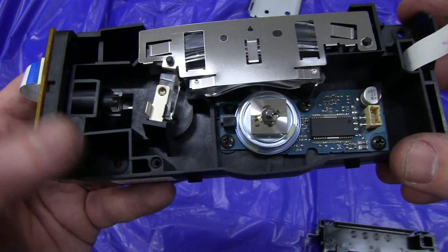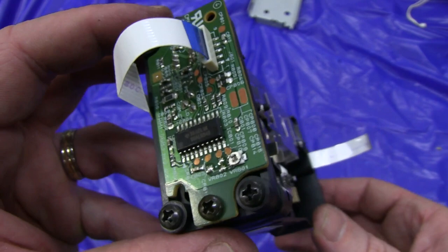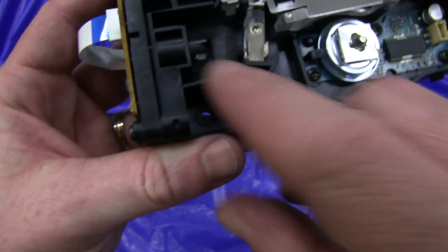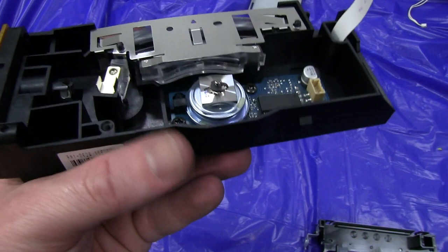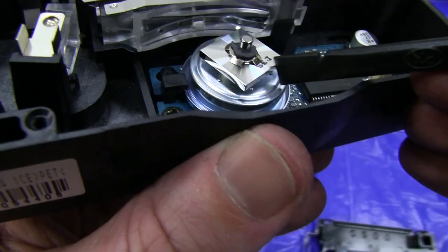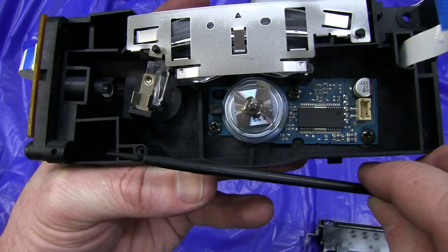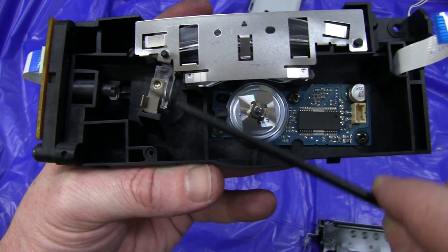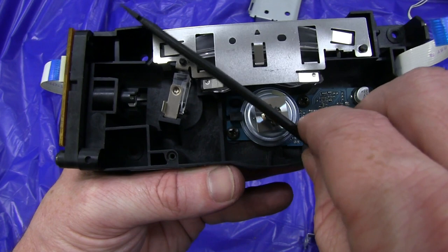This is the driver board for the motor — it went off to the stepper motor which we scored. That's a Mitsumi 7.5 degrees per step stepper motor — very useful indeed. And this sucker looks like we might be able to just pop the lid off and have a look inside. The laser module bounces off the rotating drum here — that's basically the principle. Then the drum, based on the timing, goes through this complicated two-step lens here and scans across the page like that, completely linearly. It looks like it has the driver on there, so should be able to hack and drive this thing fairly easily. Here's the laser module over here — looks like the laser module driver, pretty simplistic interface.